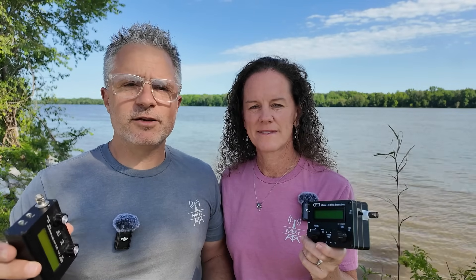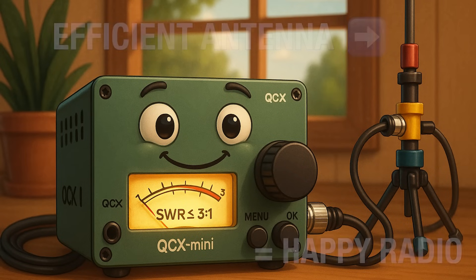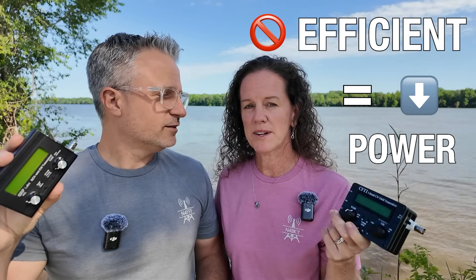The tuner doesn't make the antenna any more efficient or effective with your power — it just makes your radio a little more happy. So by choosing not to use an antenna tuner, we also pick antennas that are efficient. With these tiny little QRP radios, we want to make the most out of all the watts we've got. Efficient antennas allow us to do that. If you don't have an efficient antenna, even if this is a five-watt radio, you might be wasting some and only putting out three watts. Every little watt counts with these.